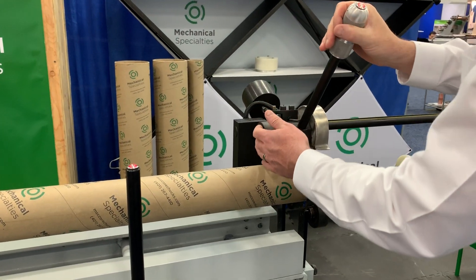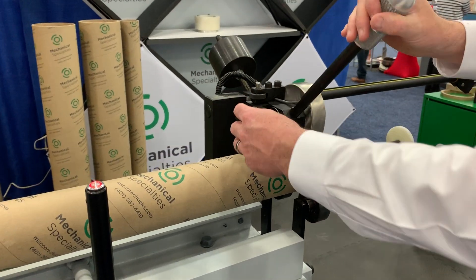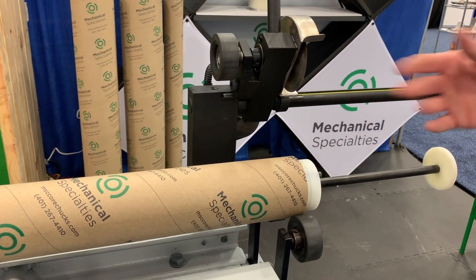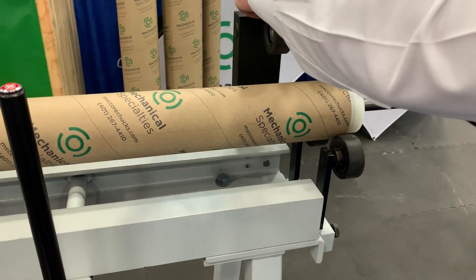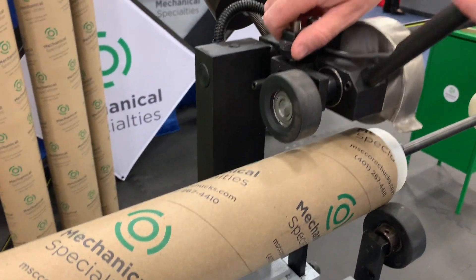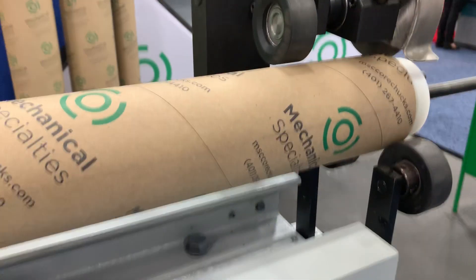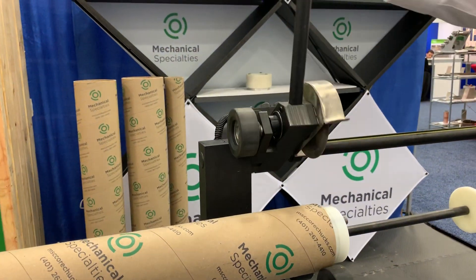In this assembly here, we have a secondary roller acting as a stop so you cannot engage the blade too deep in the platen. This will thus create more life for the plastic platen. It is adjusted by this screw on the side. Simply by placing the blade just touching the platen, you can then turn the screw and this wheel will come down just until it touches the cardboard tube, so we know we will just cut the cardboard tube and won't be cutting the plastic.